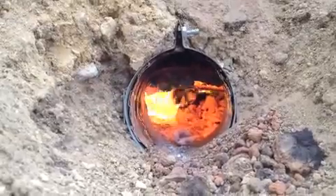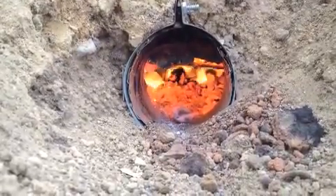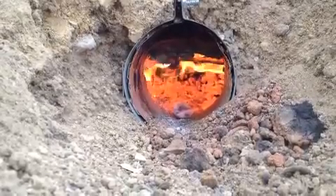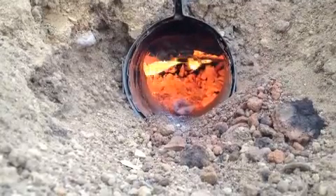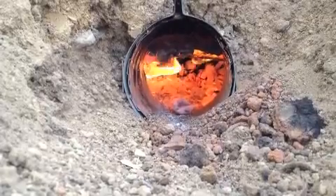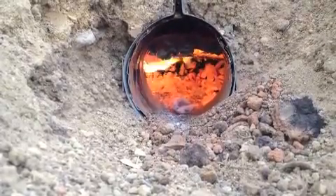Here's One Straw Rob out at the Energy Farm. This is the air inlet for our Retort Biochar Stove. What you're looking at here is the flames shooting out from beneath the 30-gallon drum inside the Retort. We are driving off the volatile organic compounds as syngas is hitting this superheated region beneath the Retort and igniting into that flame.